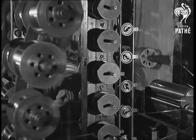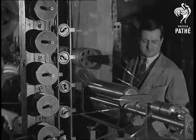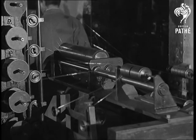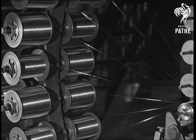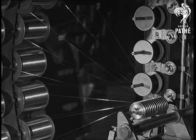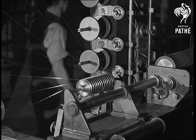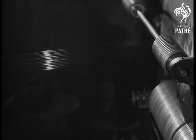The process of immersing and baking the wire is repeated several times until a coating of enamel of adequate thickness is built up for the purpose to which the wire will be put. The enamel used has extraordinary qualities as an insulator and in nearly all cases is the only insulation with which the wire is provided. It will stand without deterioration temperatures which would destroy insulation of a fibrous character.